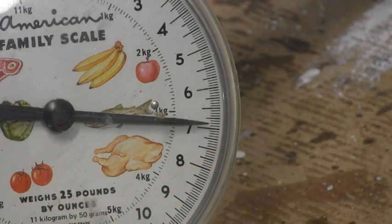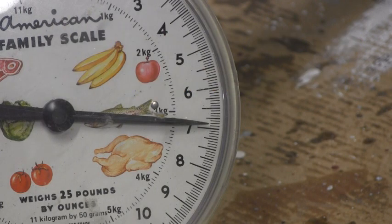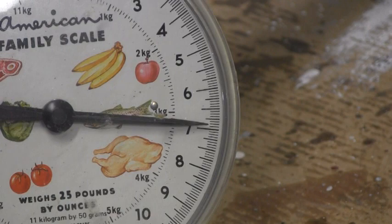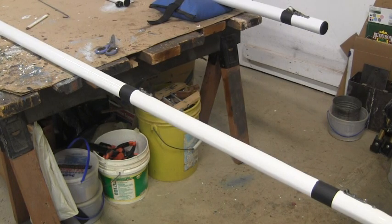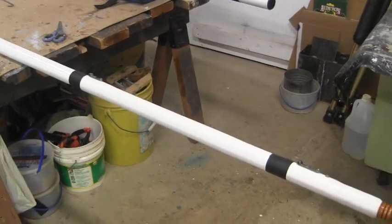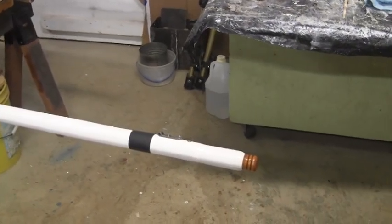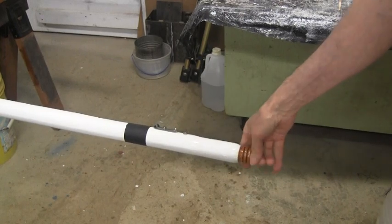That is the weight minus the two RL205 blocks. I thought I had two of them — I had some of the little blocks but I didn't have the ones with the swivels. They're still on the aluminum mast, and I forgot to order them when I got some of the stuff for the fiberglass mast. But I won't be using the mast for a while, so it doesn't really matter at the moment. Where the RL318s are, I added some gaffer's tape — it's kind of like a heavy-duty friction tape — to keep the blocks from pounding on the paint. And then I've got my little knobby down here, all coated with some marine varnish.